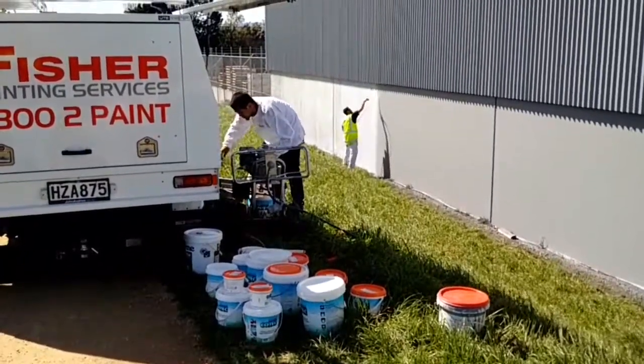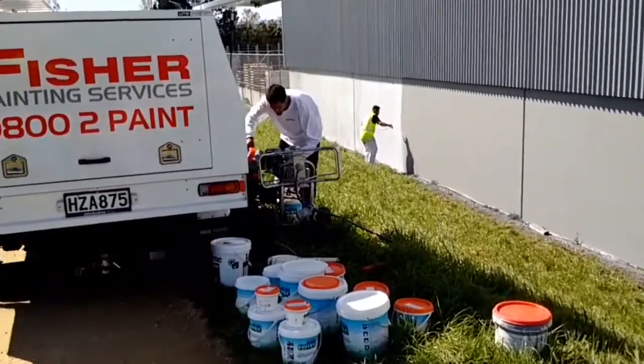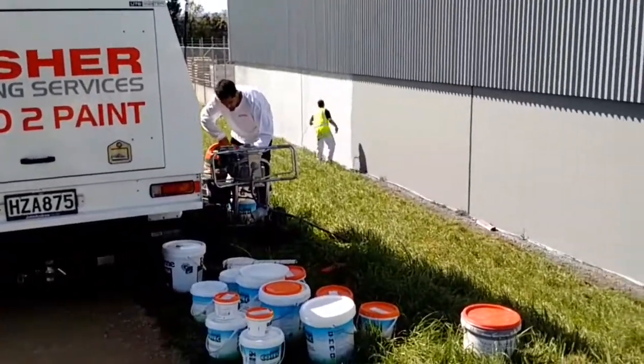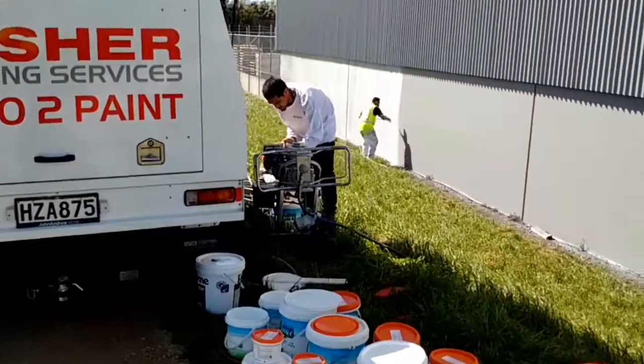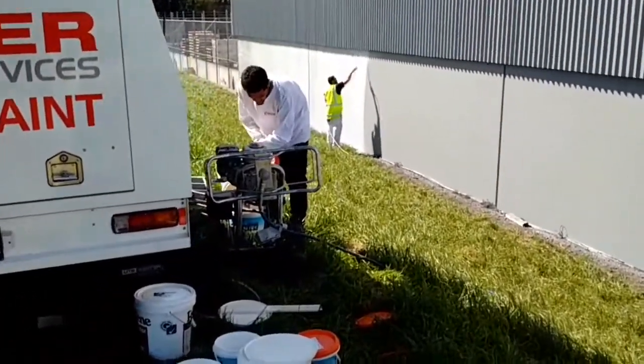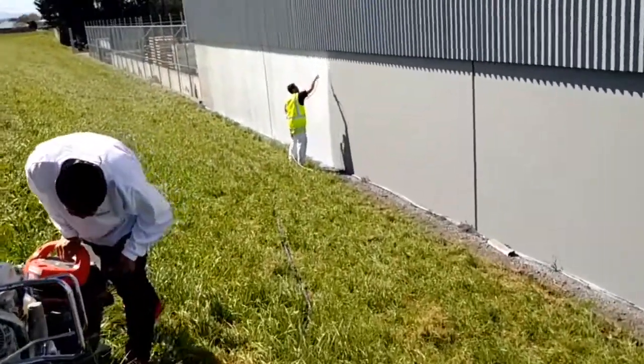This is a 2-pack urethane water-based system. It uses the Kotec D-Pag gel, which is water-based and environmentally friendly for removal of graffiti. Simply apply by brushing on and rolling on, then scrubbing off and washing off.